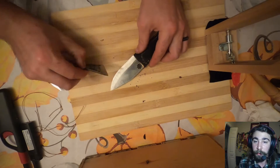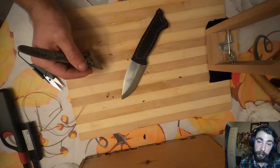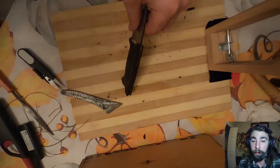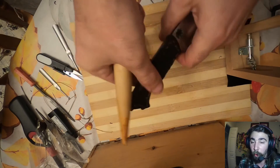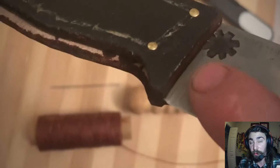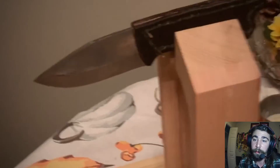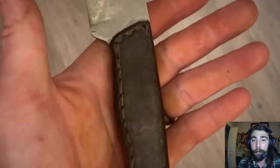You can see there I'm slowly trimming out a small portion around my trademark. I ended up taking out that whole finger swell area and just cutting it straight off because there's no point in it being there. I'm using a file and a knife I made for leather working to shave off all the extra leather, then using more of that beeswax and olive oil mixture to burnish — it works amazingly well. The handle glides so smooth and feels so good, soft but also tight.